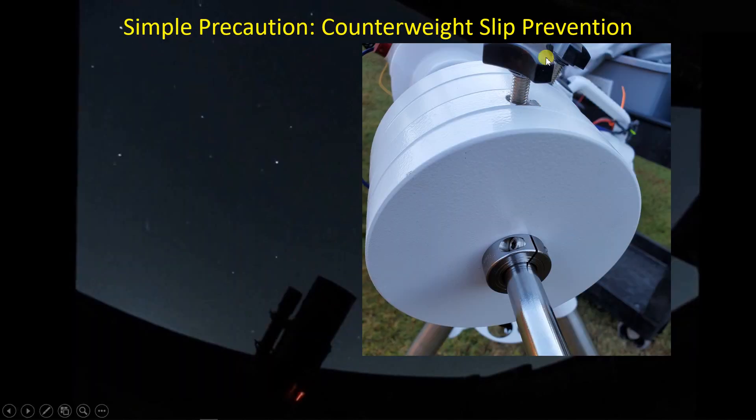I just can't stand these little tiny handles here for the counterweights. There are two 11-pound counterweights and I just don't trust these things to tighten enough so that they bear into the shaft and hold the weight. To avoid the potential disaster that can come if these weights drop down and hit the restraint at the end of the counterweight shaft, I purchased a shaft collar.